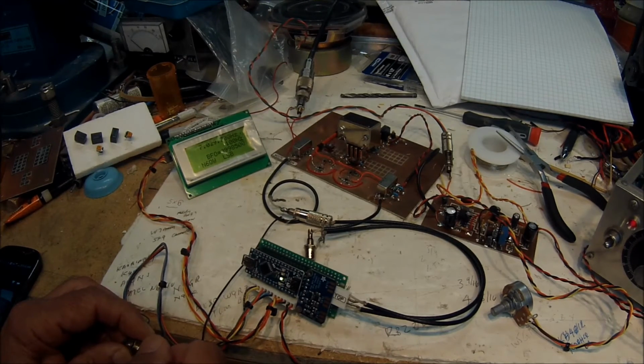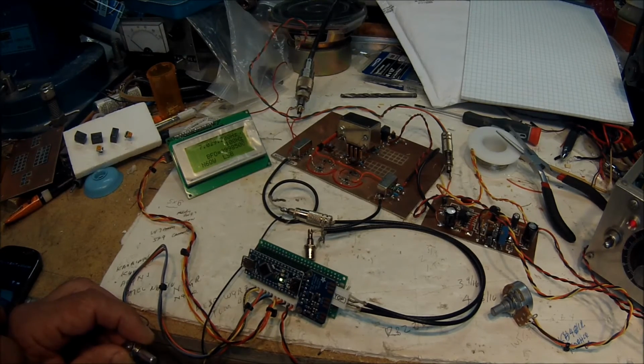There was a contest on a couple days ago. Actually, you can make this tune in 10 hertz increments, but I've just nulled that out in the software. This is Pete N6QW using my test bed receiver transceiver board with the Si5351 acting as the LO and BFO. I'm driving the Adafruit board right here, which costs less than $8, with an Arduino Nano. So not much there. And I did add the capability so that you can switch the sidebands.